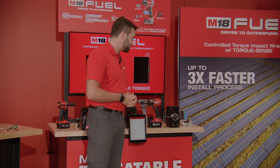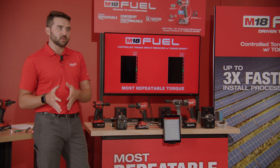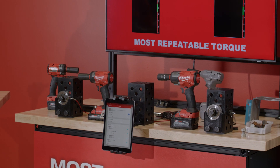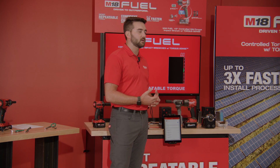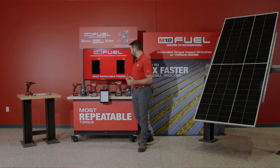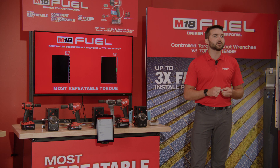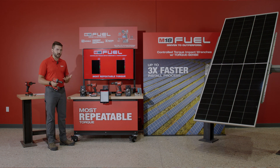What does that process currently look like? Right now a two-step process is being employed on the job site using just a standard impact wrench and a manual click wrench. Before we demo that, I want to talk through the setup in front of me. I have two joints here — one being a standard joint with a torque transducer in the middle to tell me my torque level, and then a more job-site-representative joint that has a nylock nut, which can simulate variability you will see on the job site. That could be from part-to-part misalignment, parts being damaged on the job site, or the environment affecting the hardware — things like threads getting gummed up or a coating being on too thick on your hardware.